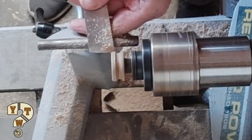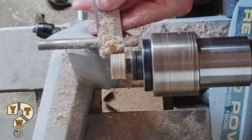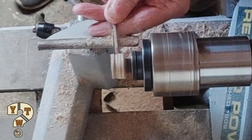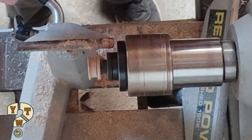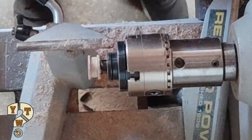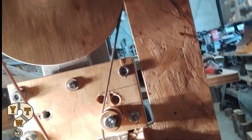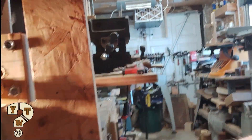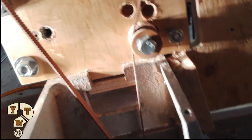Here I'm just modifying the tension pulley which was used for the round belt system previously and making it flat for the new timing belt. Because of the new pulley setup, I'm hoping the mechanical advantage will make the cutting action less prone to belt slipping without putting too much strain on the teeth of the belt. Here's hoping.